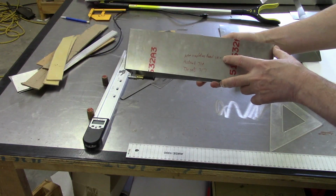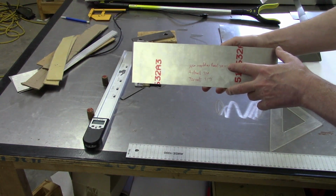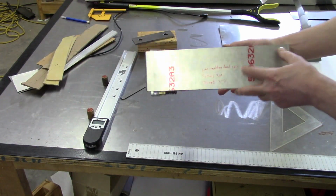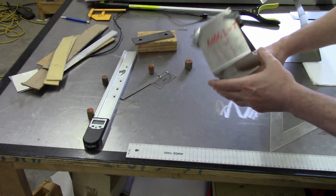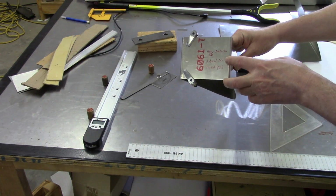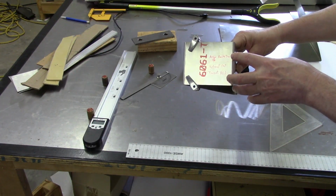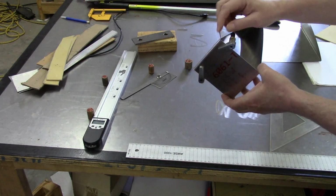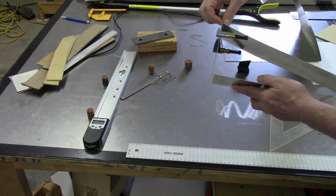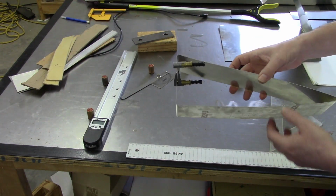And then the other thing is I took another measurement after I had gone ahead and bent this section. And it actually may have gone down about 1/2 millimeter or so. Of course, 1/2 millimeter is sort of hard to measure as far as sheet metal goes when you're bending it, because it's got so much flex to it. But still, it's more than close enough. And then finally on this side, the actual was 102 and the target was 103, so that's 1 millimeter. That's good. And then actual bend afterwards was 106, and that's basically just taking into account this little curvature right here, because you only want this to come up as far as where the bend radius actually starts. So again, this one came out pretty well, I think.